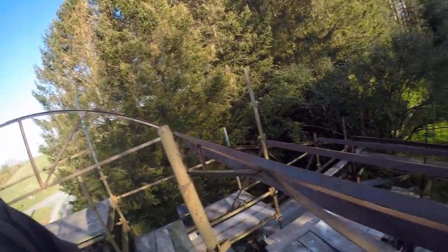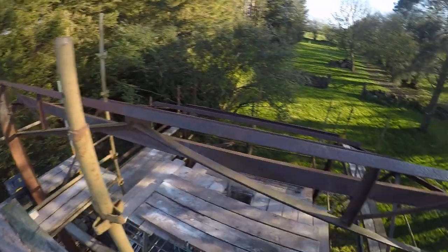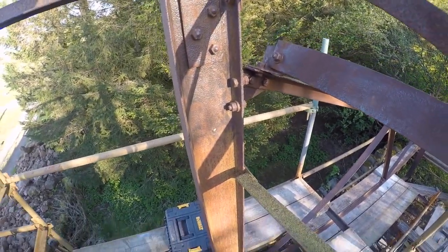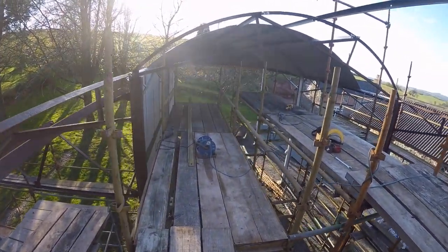It's now a few hours later on, four hours or something like that. I've got a bit done — got a couple of trusses. The sad thing is it doesn't look that much different to how it did before, unfortunately. There's a lot of algae on this because a lot of the roof has been gone — I don't know, twenty-odd years or something — so there's a lot of just junk, rust, all sorts on there really. I'm just trying to get that off the best I can before I put rust killer on it.